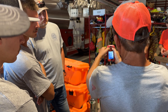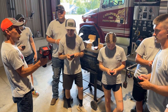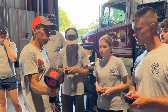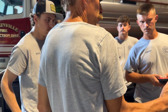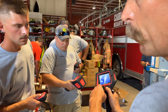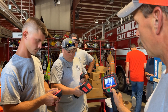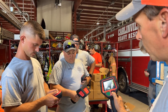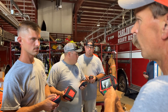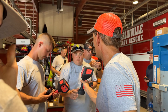Hit it twice and cycle through the different modes. On the big camera it's a little different — you're going to hold the black button for about two seconds: one, two. It switches — see how it's in temperature mode now. Ready: one, two — and now it switches to survey mode. So small camera: both buttons at the same time. Big camera: black button for about two seconds. One more time: one, two — it switches. Now you're in regular thermal mode; one, two — and now you're in spot temperature mode. We never focus on spot temperature — hold it, one, two — and now I'm in survey mode.